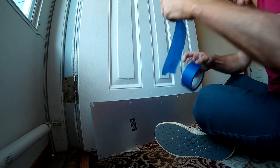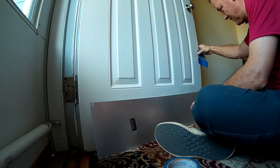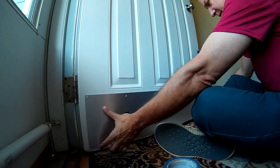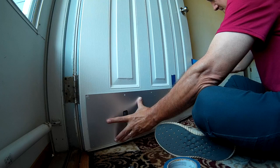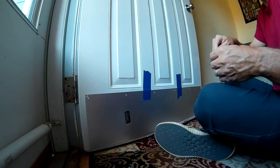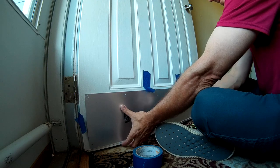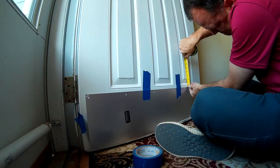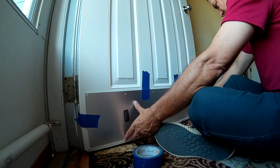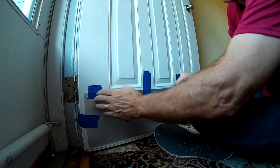I just want to show you that the hardest part about installing this entire kick plate is actually just getting it lined up on the door. I had to do a lot of measuring and a lot of testing. I highly suggest you use tape — I used some painter's tape I had laying around. I taped it up there a couple times, did all kinds of tests, and finally got it where I want it. Mine ended up being 35 and a half inches long across the front bottom of the door. The kick panel was 34 inches, so I took about three quarters off each end to line it up evenly. I did the same thing for the top and bottom too, ending up at about eight and three-eighths inches. It lined up really well both vertically and side to side.